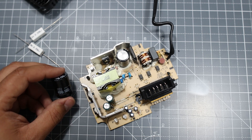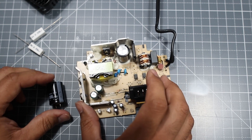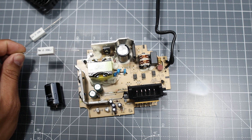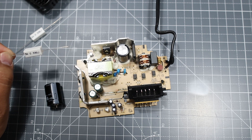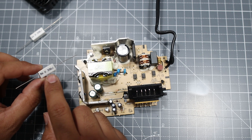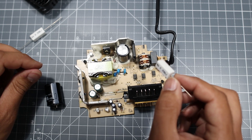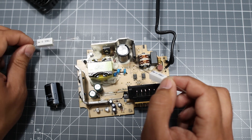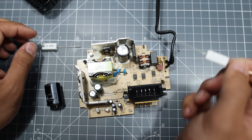On this circuit board we're also going to put in two ceramic resistors. Ceramic resistors handle heat a lot better. These are 5 watt 0.33 ohm resistors. We're going to put one on that little jumper there, and the other one on the jumper here on the front, as you can see right there.